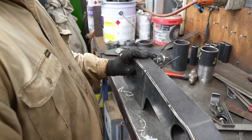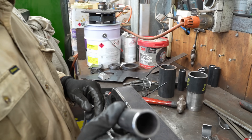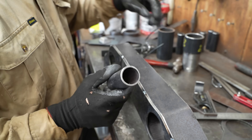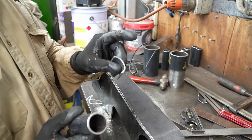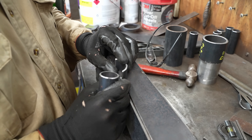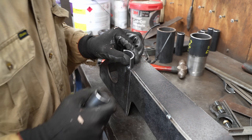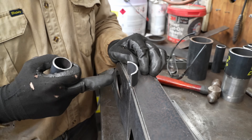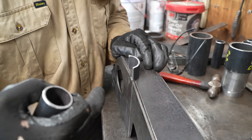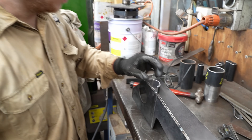So how are you going to tackle this then? I've already pre-cut our pipe — I've pre-cut six of them already, and I've also pre-cut our scallop beforehand. So the scallop will go in there like this. We'll put that like that, trace it, and go out there and cut it. How do you cut it? What I usually do is I'll do a heap of little cuts, and then I'll come through on the side and go around with the grinder. Little wedges — yeah, little wedgies.